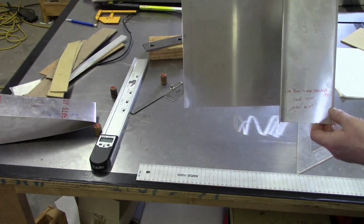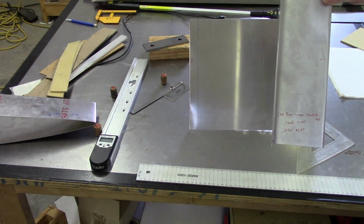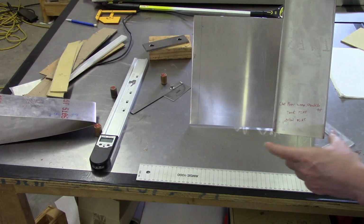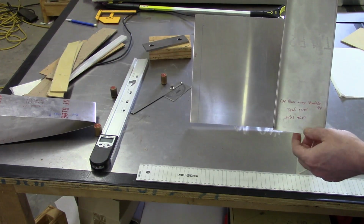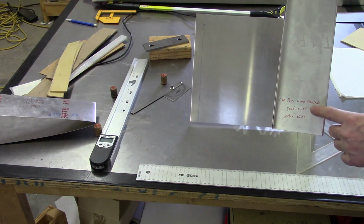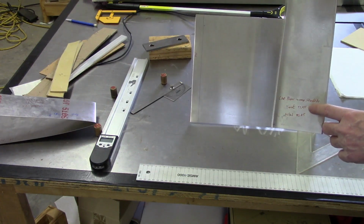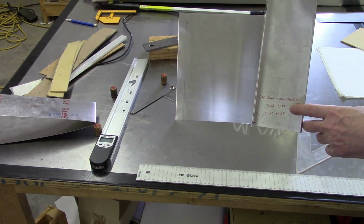Again, not something that I would scrap my part over, but it's a little further than I like to see. And then actually on this side I had a problem: the Zenith plans were correct, but then I made a mistake when I was translating everything over. The total height of this should have been 94. And I was shooting for roughly 97. So as far as bend goes, the actual bend was a little under 97, and target would have been a little over, basically within a millimeter. So again, as far as accuracy goes, as far as the bend, that's acceptable.